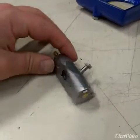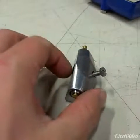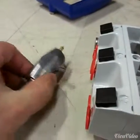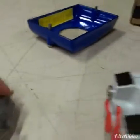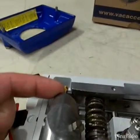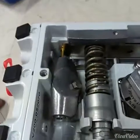Going back for reinstall, I just want to make sure that I have it lined up appropriately. The one air port should be facing the actual pneumatic ports. There are four O-rings on the bottom here. I want the slotted end of that rod up toward the metal reed that it came off. Then I'm going to slide it on there and tighten down the screw — just snug it down pretty decent and you should be good to go.